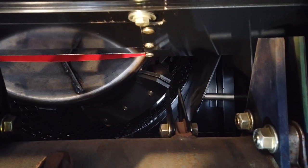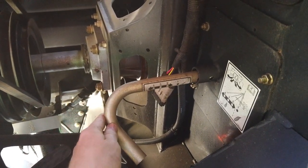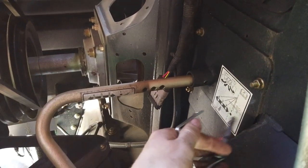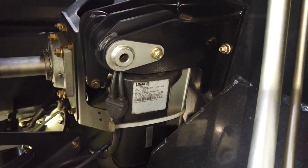This will vary depending upon the moisture and weight of the residue. Adjustment is carried out by moving the deflector, located between the rotor and the chopper, to the left, in, or right, out, using the manual or motorized lever on the right side of the combine.